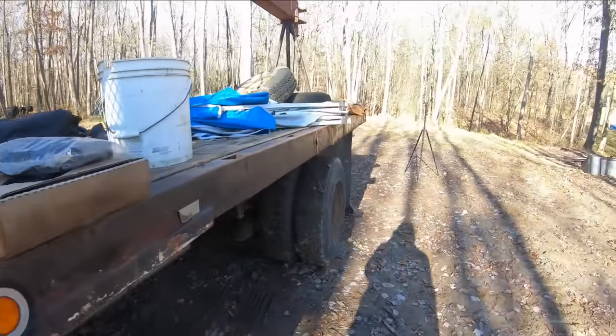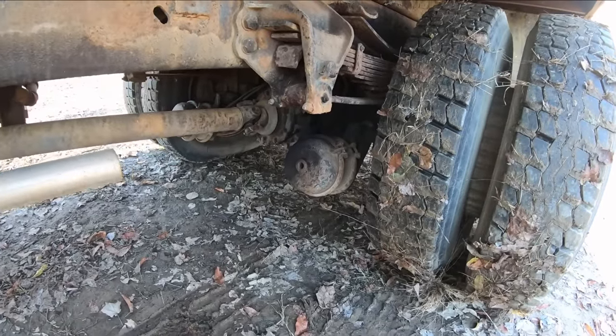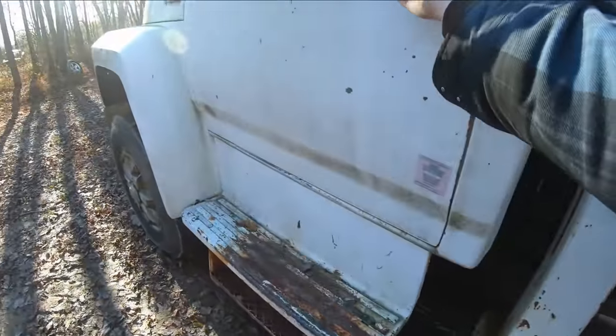So I shut the truck off so we can hear now. And immediately I can tell we have a serious air leak in our maxi can right there. Let's go ahead and pull the brakes so that we're not just blowing all our air off.